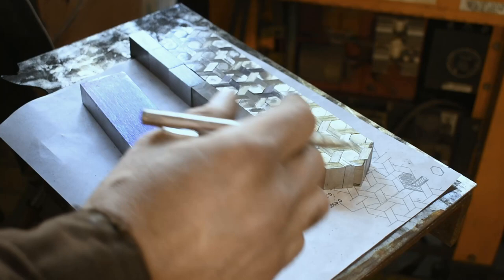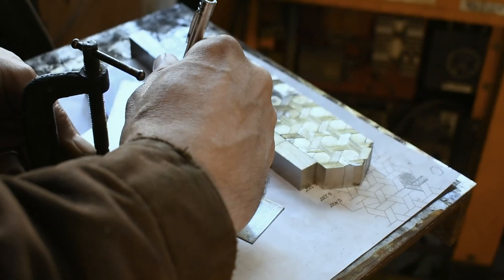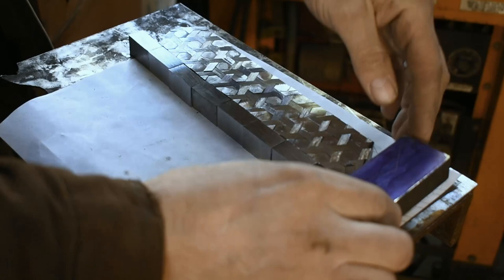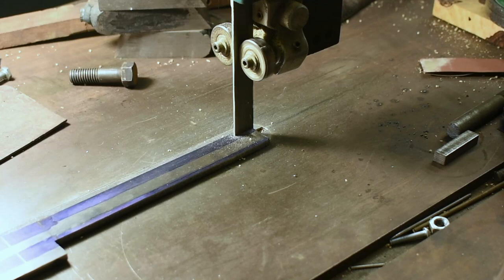I've got both my bandsaw cuts scribed on — there's just a short little piece of waste block right now. I've taken a couple pieces of 15N20 and created an angle template based on the end of the composite billet, using that to scribe a line onto there at the centerline I found. I actually ended up doing it a slightly different way off-camera, just because my battery died and things like that.